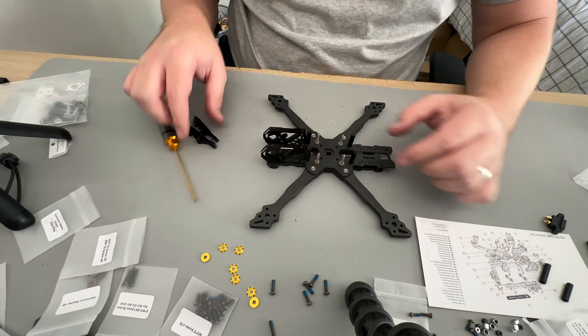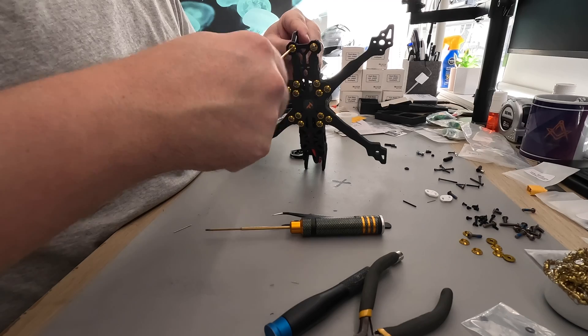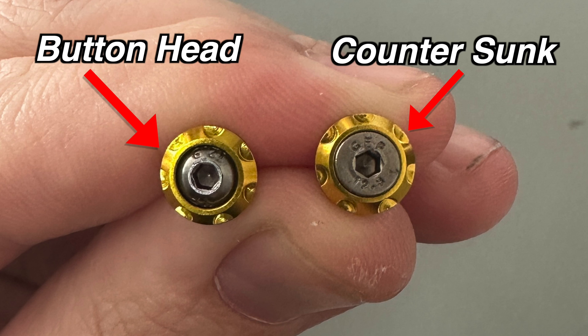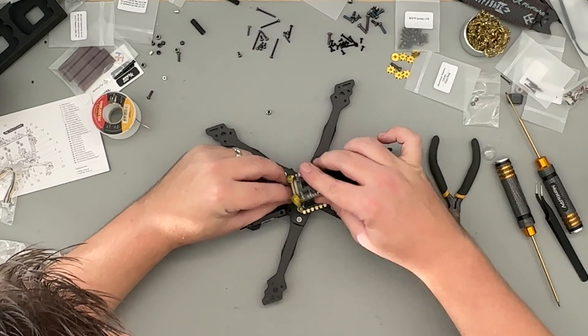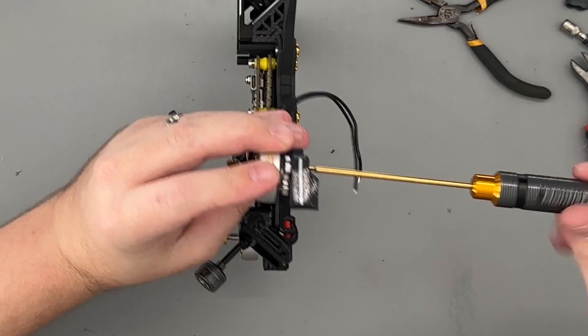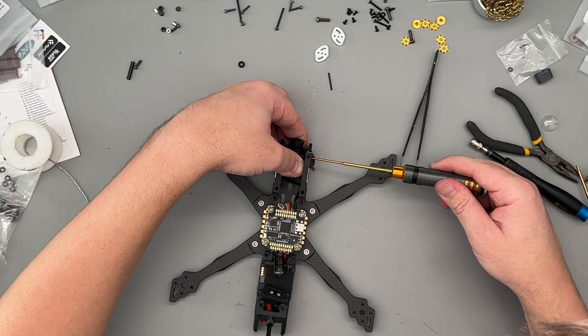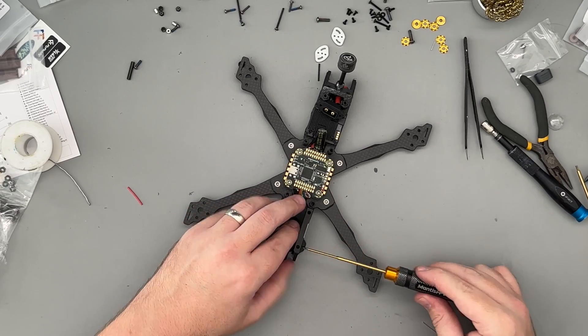During the build process, I noticed a few more small changes based on community feedback. The first and most obvious was the inclusion of aluminium washers that go on the bottom of the frame to protect the screws from damage when you hit the concrete. I prefer countersunk screws into the frame instead of washers, but these are low-profile washers and they aren't as obtrusive as what you'd find on other frames, although I would have preferred countersunk screws instead of button head. For the rest of the build, it was simply a matter of installing the Avatar V2 VTX and the Speedy-B F405 stack before bolting on and soldering the motors to the ESC. Mounting the camera in the CNC camera plate, there should be no jello or jitters, especially if you're using the DJI O3 or the Avatar V2, because of the silicon camera mounts that come for both 19mm and 20mm cameras.